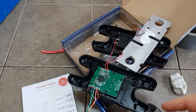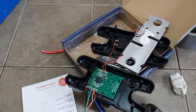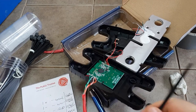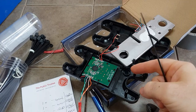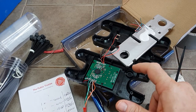What I've done in the past to get the cable out is to just drill a hole here and pop the cable out through that hole. I don't have a drill with me at the moment, so I'll leave that to your imagination. But what I do recommend is that you use a cable tie to wrap around this cable at a point that allows sufficient slack inside, so that we're not pulling on the connection points to the circuit board. The hole is just wide enough to allow the cable through but not wide enough to allow the cable tie around it, so it acts as a stop.